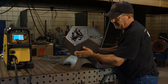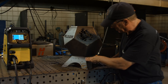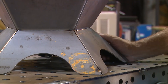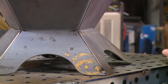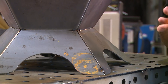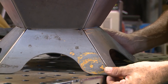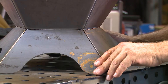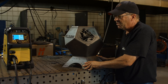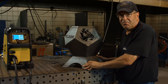I'm going to start welding this. As I mentioned in another session, we're going to have a little bit of variation in our fit. Naturally we'd try to get everything with the exact same gap — that's our intent but it doesn't happen that way all the time. I'm running off an ESAB Rebel, 110-volt input, .030 wire, 75-25 gas, about 25 cubic feet per hour.